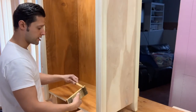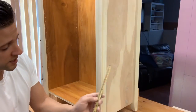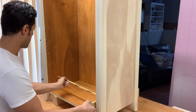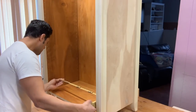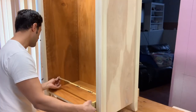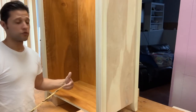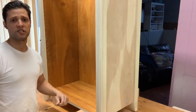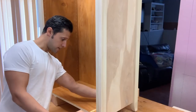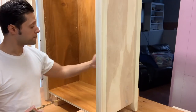I'm going to open it up like this and put it against one side. It has this little extension piece — that piece pops up right there, and what that's gonna do is allow me to hit that wall so I can see the inside measurement. So that's an extra two inches, making it 27 inches total. What I'm gonna do is take off maybe a little bit of a sixteenth of an inch, so I'm gonna cut the shelf at 26 and 15/16 light. For the front, I'm gonna make it a light cut on 15. So we've got 26 and 15/16 light by 15 light.